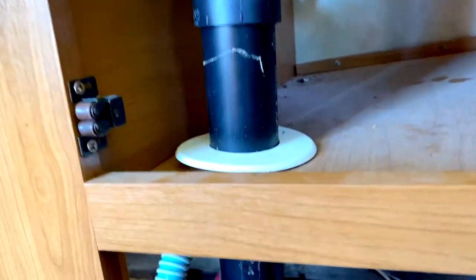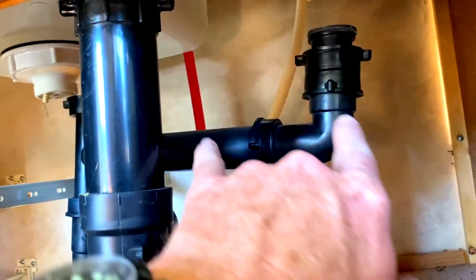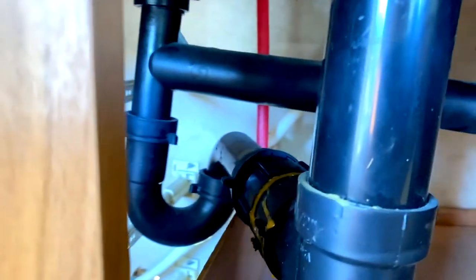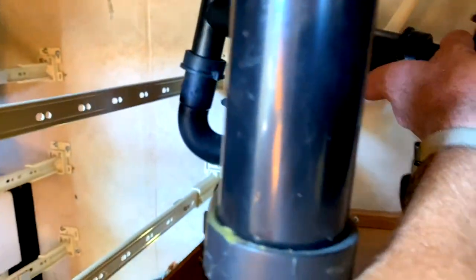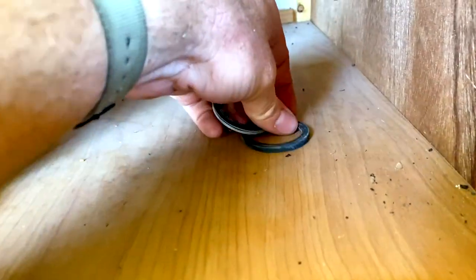I'm going to start with the sink drains. I went ahead and unscrewed both sides of the sink, then followed on around through the p-trap, and then unscrewed it where it comes in to this piece here so I can actually just pull this out — a couple of washers there — and that comes out, freeing our sink.